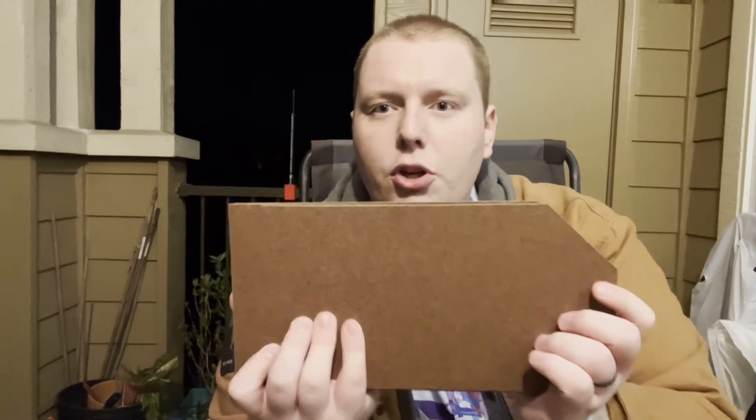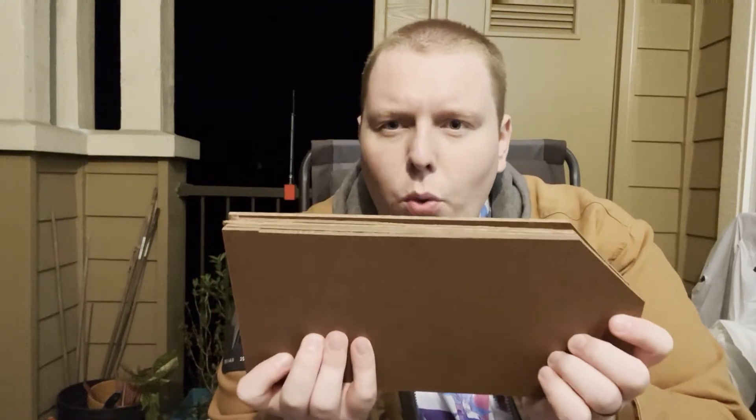Here I've got all of the hardboard vanes that I cut the other day. I cut each one of these individually with a jigsaw, so they're not perfect. If you just hold them like this you can tell there's quite a bit of variation between them, and so there's going to be quite a bit of weight variation between the blades. I've had it happen before where a couple of the heavier blades got on one side and the whole turbine was off balance.